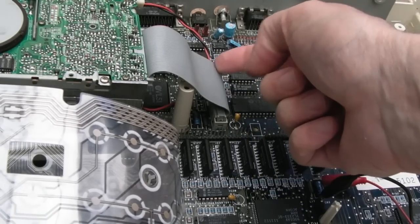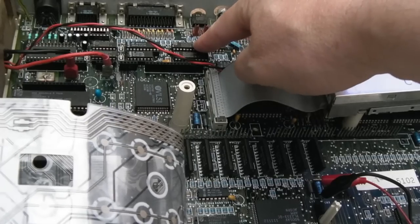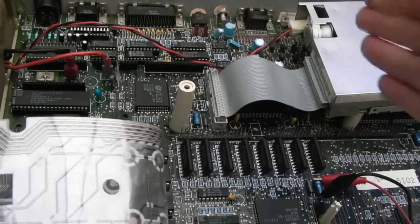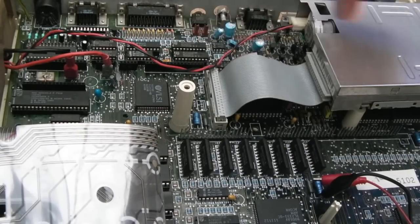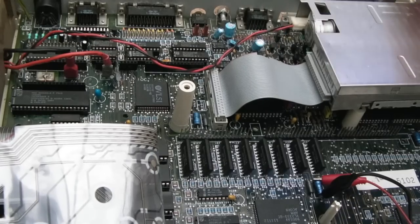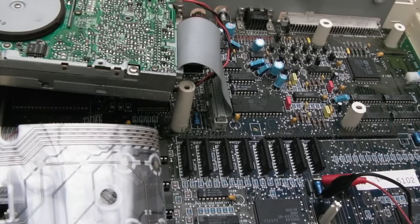I think some of the signals come from the BD bus. Now the BD bus, let me just show you, you've got these 574s here, which are flip-flops with an output enable, I think. So they're sort of buffered. It's like a flip-flop with a buffer on the end. And data comes through these. I'm not sure whether the drive picks up from there, but it may well be that something is enabling these when it shouldn't be, or something is enabling something else here related to the drive, which means the drive's picking up noise off that bus. That's what I'm thinking.